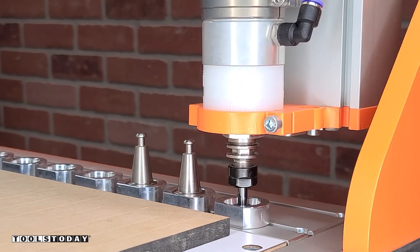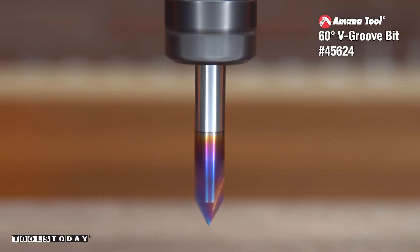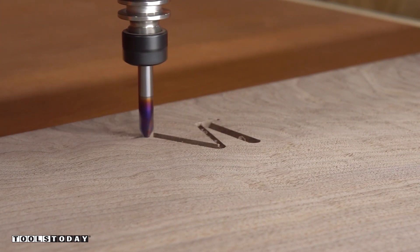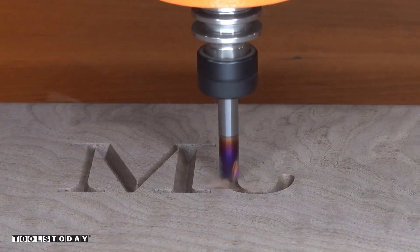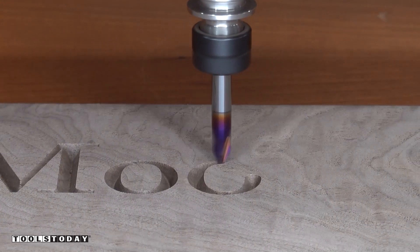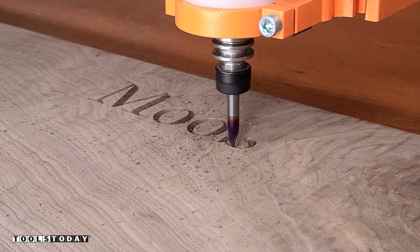We're going to pick up the 45624-K 60-degree spectra coated V bit to do the engraving on the name. We're going to carve in my dog's name — his name is Moose. This bit is doing a great job going mostly cross grain on this walnut, leaving a really nice clean cut even through some of that really difficult grain. We got all of the letters carved out here.